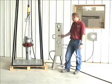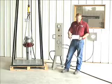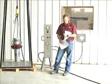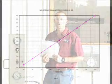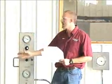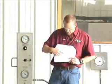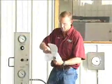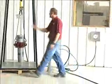And when lifting and coming out of the hole, you look at your manual — we have graphs in the manual that tell you, with the load you're carrying, how much PSI, how much air-regulated pressure to put into your system. This happens to be 500 pounds, so we would put in right around 70 PSI as stated on the graph. At 500 pounds and 70 PSI, the cylinder should be halfway stroked.